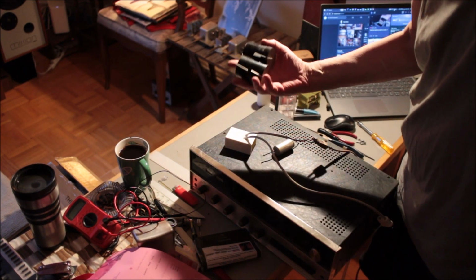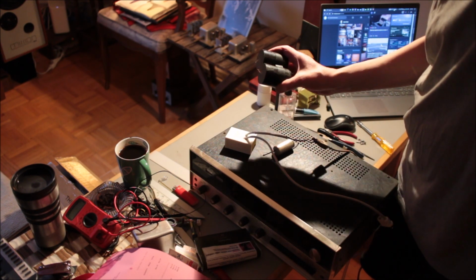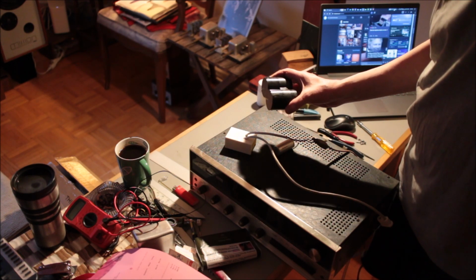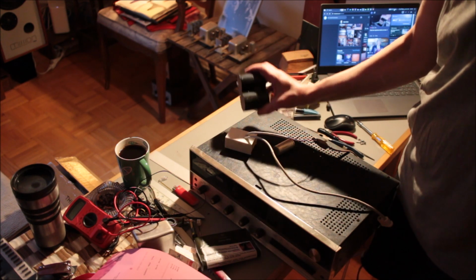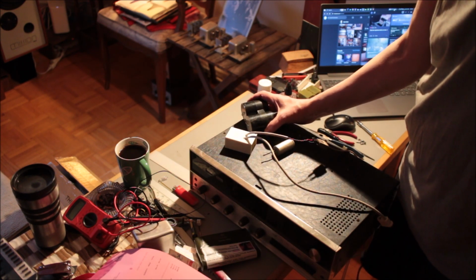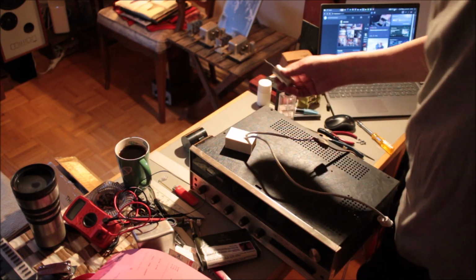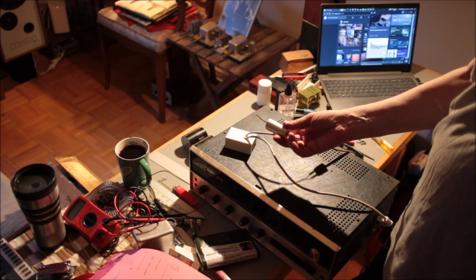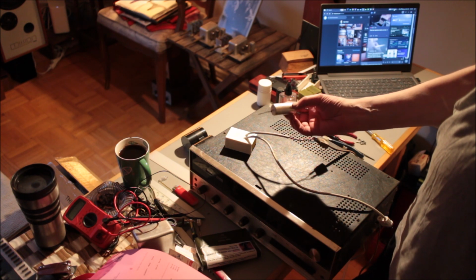This is what 200 microfarads looks like in film capacitor. Now, do you honestly think I'll be able to stick 900 per channel? That's 300s and that's 200. I'm starting to have my doubts. It would need a second chassis. This just doesn't get it. But it will get 2,000 microfarad electrolytics. I'll try to get ones as nice as this Mallory.